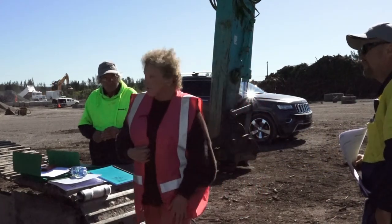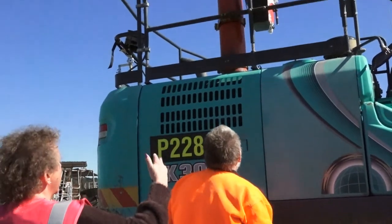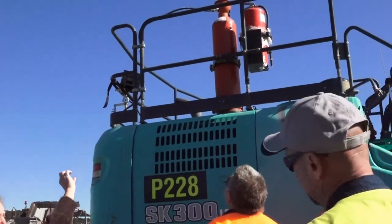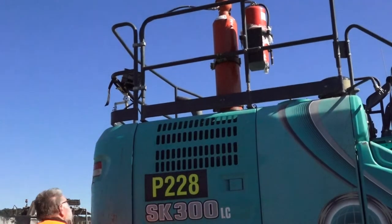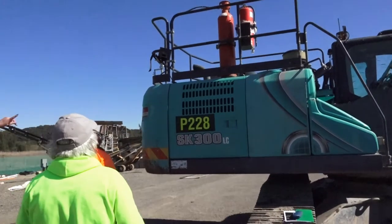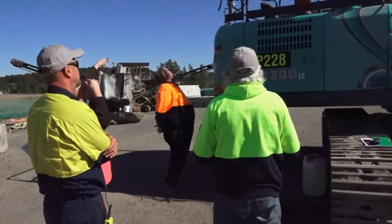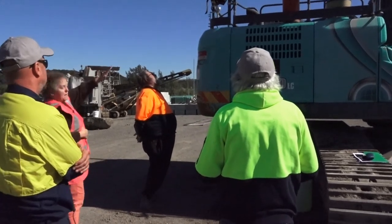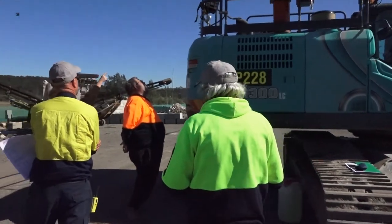If you just have a look here, where you're comfortable with moving it to, the mechanic can move it to. You see the hand wheel on the cylinder? It's a left-hand thread because it's hydrogen, so that you can't make the mistake of the wrong cylinder. The cylinder's coming down, the 200 bar hose is coming down into a regulator. Ross has just put the box here last night for our benefit. It's a two-stage regulator. If you want that moved away because you know where the heat factor is, the mechanic can do that for us.